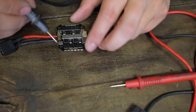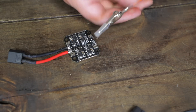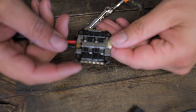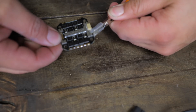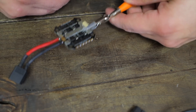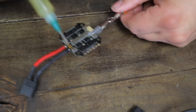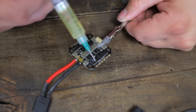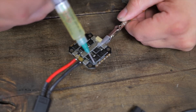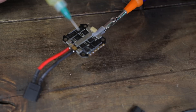So we're going to replace this MOSFET. We are going to hook this guy up here and put some flux onto the board. These require quite a bit of flux — like I said, it gets hot but it dissipates the heat so well. So I put quite a bit of flux and I'm really going to have to heat this thing up.